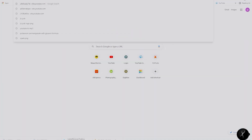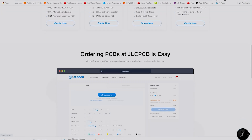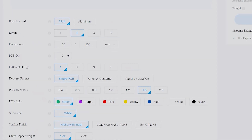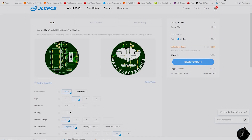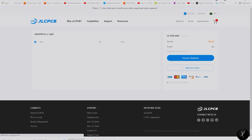First of all, I'll show you how to order your PCB from JLCPCB.com. Go to the JLCPCB website, press the instant quote button, and you will see a page where you can check your PCB parameters like dimensions, layers, and quantities. Add parameters according to your need, then add your Gerber file, your shipping address, and save to cart to check out.